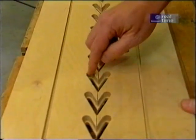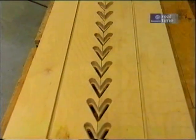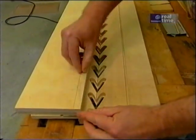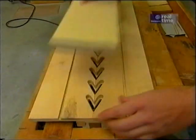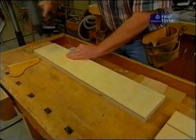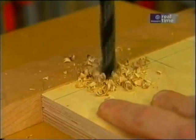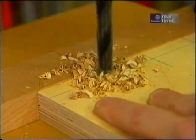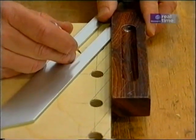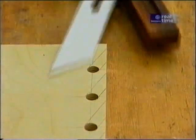The jig uses a router with a collar and a quarter-inch bit, and the collar rides in these V-shaped slots. It would be nearly impossible to cut nice crisp slots in the middle of a piece of plywood. But if you're willing to cut the jig in half and start with two pieces, I can lay it out, drill holes and cut slots for the template. So the first thing I'm going to do is tack these two pieces together. Next I'm going to drill some half-inch holes two inches on center using this line on my fence as an indexing point. Using my bevel gauge, which I've set the inside angle to be 25 degrees, I'm extending lines from the hole out to the edge.